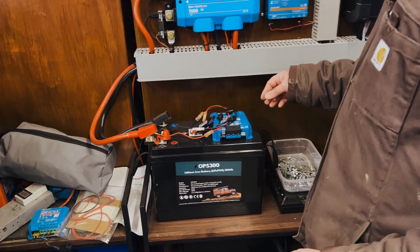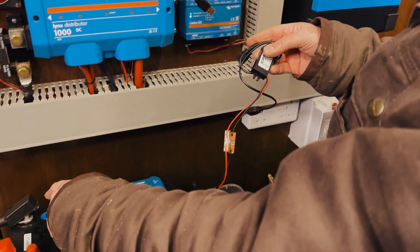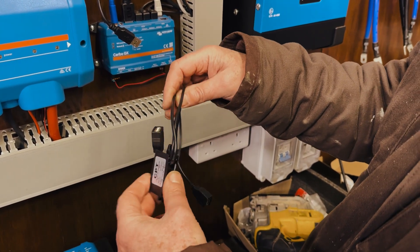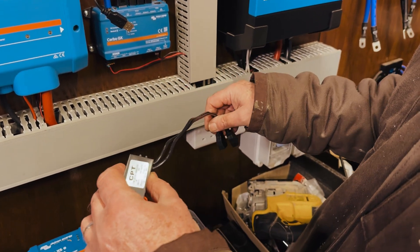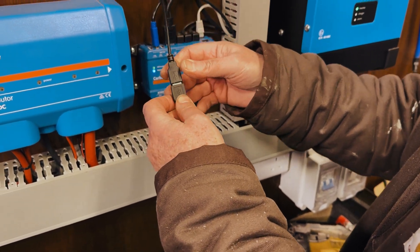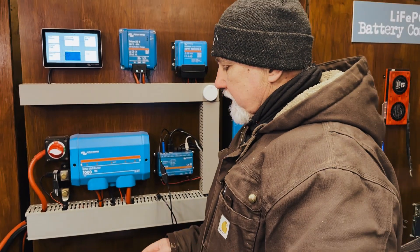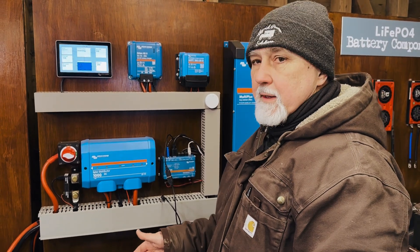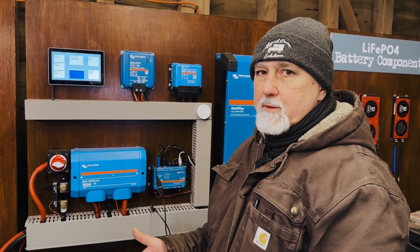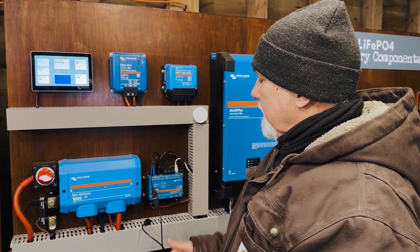What we do — I'll bring you over here — we have 12 volts connected with these connectors, going into this little USB device: 12 volts in, 5 volts out, with two USB plugs. We plug that in, and as you can see the screen has come alive. We find this is very stable. We can run quite long distances on 12 volts, and if the distance was too long for 2.5mm cable, you can just increase that to 4mm and you wouldn't get much voltage drop. Terminating with the little adapter, the screen is quite happy and responds nicely with no instability.